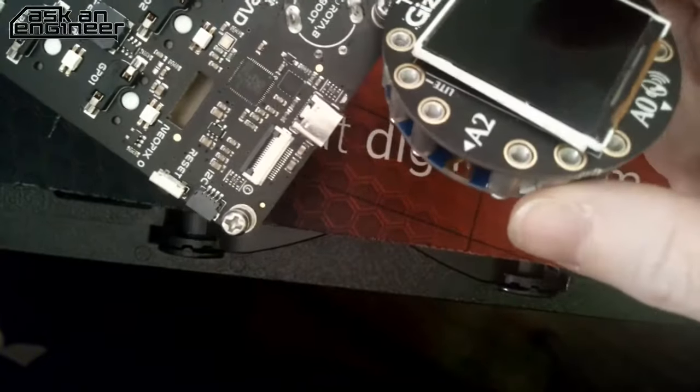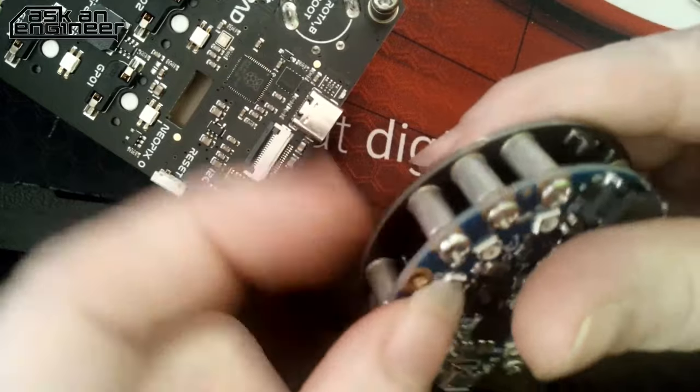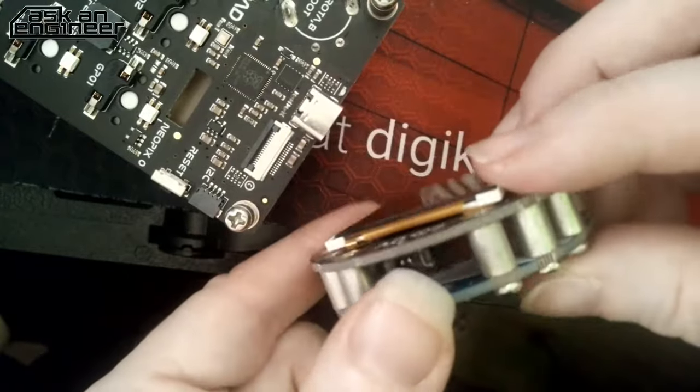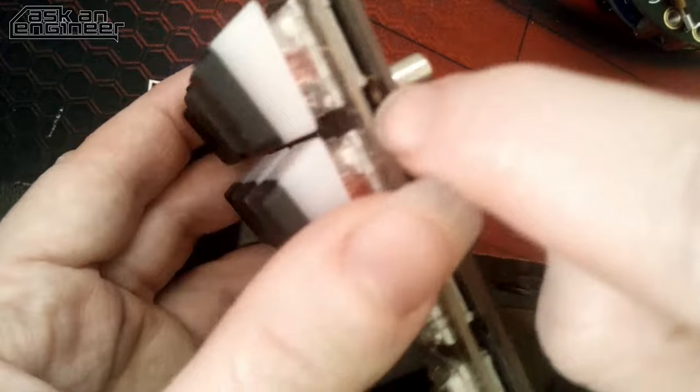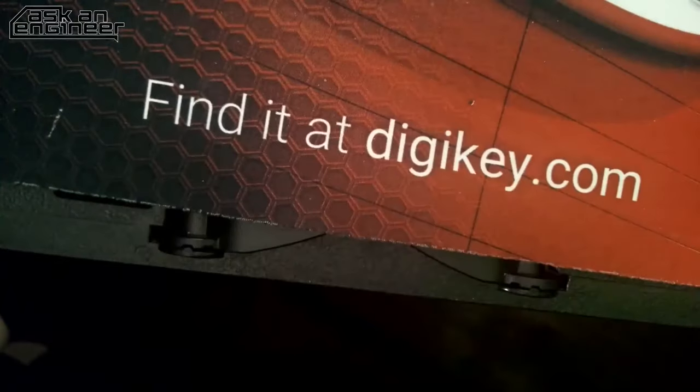This design uses very tall standoffs that sink into the PCB but solder nicely — look at that fillet, very nice soldering. Then you can place the Circuit Playground on top, bolt it down, and it makes both a mechanical and electrical connection, which is super fun. For designs where I can't have a hex nut or bolt head on one side, this makes such a nice flush standoff — I have a bottom plate and screw it on with machine screws, without the fiddliness of holding a hex nut while trying to screw it in.